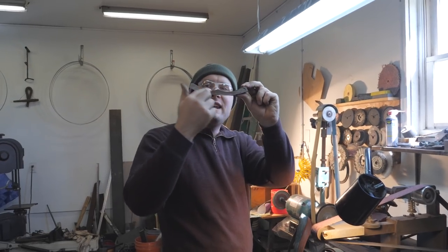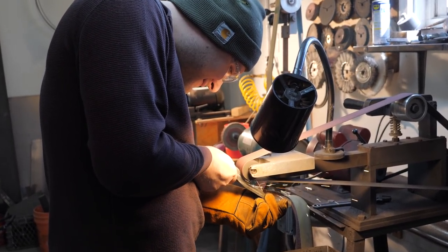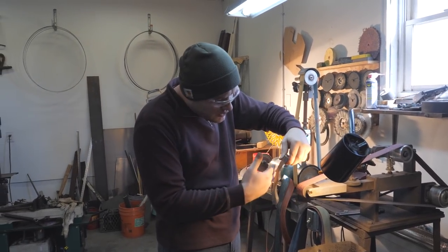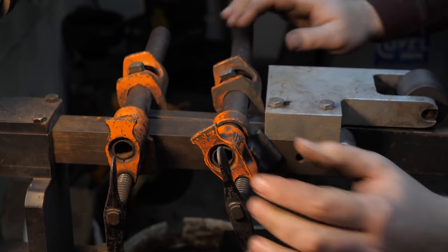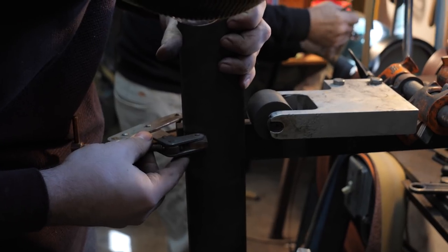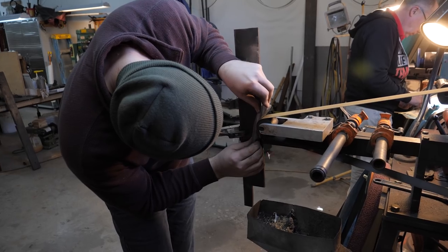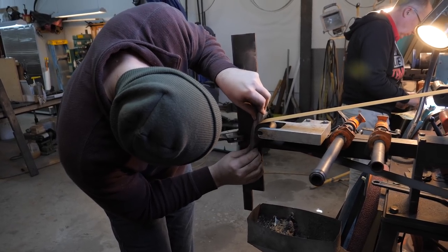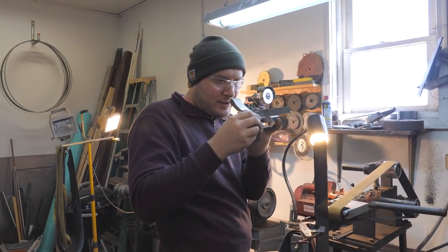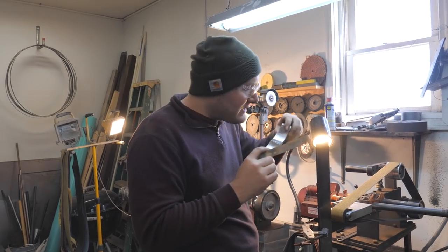Got the pattern roughed in. The next thing I want to do is get a backer put up against the round wheel so I can hold it square and clean up the curves I put on each side of the guard. I don't have a horizontal grinder — it'd probably be a lot easier on one. I'm going to call that square right there; it's plus or minus a few thousandths, which could just be from me applying more pressure to one side or the other.